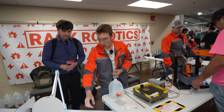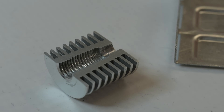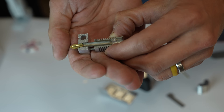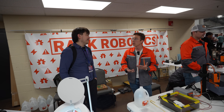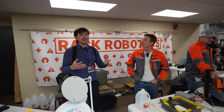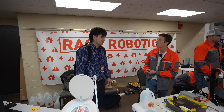This is an example of something we cut — we cut that with the Ender 3. You can see there's a really inconsistent material thickness, but we're still able to cut that. And this is the hot end that was on that Ender 3 before we put the wire tool on there. So you've got brass, aluminum, steel, and hardened steel — all together in one piece that was cut in one go. There's a lot of use cases in industry and hobbyist stuff where you want a hardened material — like a wear plate, mold, or die. This EDM doesn't care about hardness. We've been die-plunging in AR500 steel and also doing tungsten carbide. We've been doing some wire on that too.